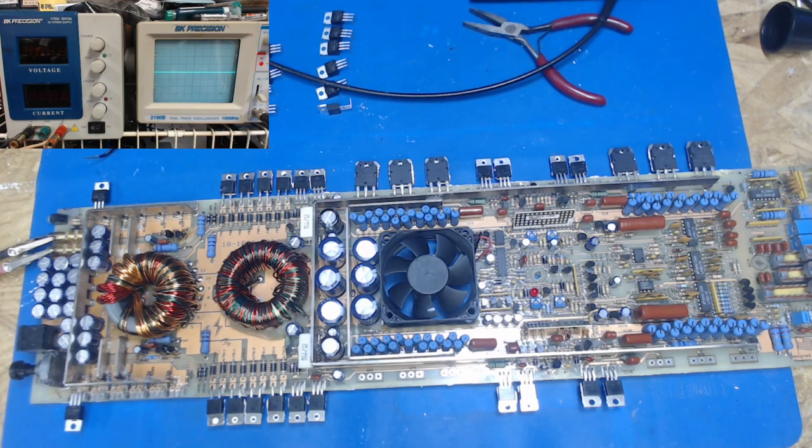All right, get my microphone down here, sorry. All right, so we've got power hooked up. I hooked up the remote. I'll make sure that doesn't get touched. I'm going to turn on the power. We always watch the power up here. It should be at about 0.18, 0.179, 0.178, something like that. That's the battery, the constant power for the memory connection on the radio, the little Alpine I use for testing on my test bench.